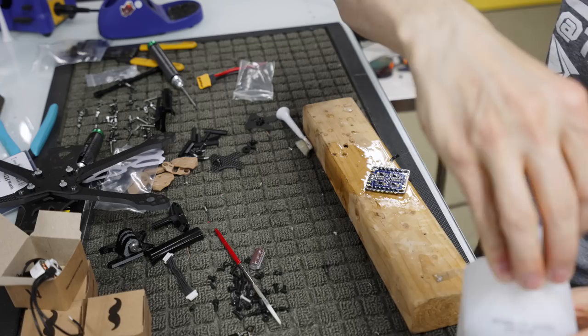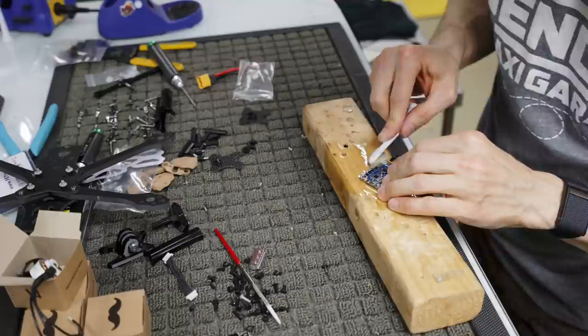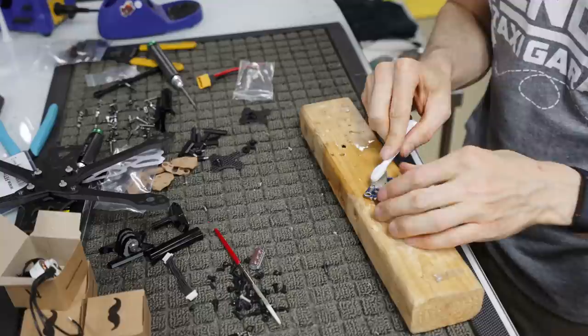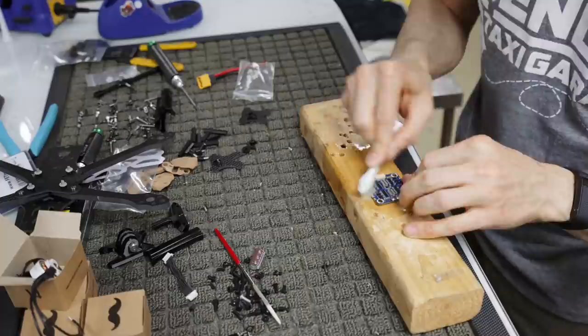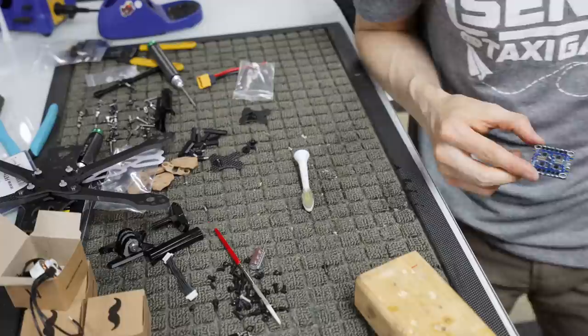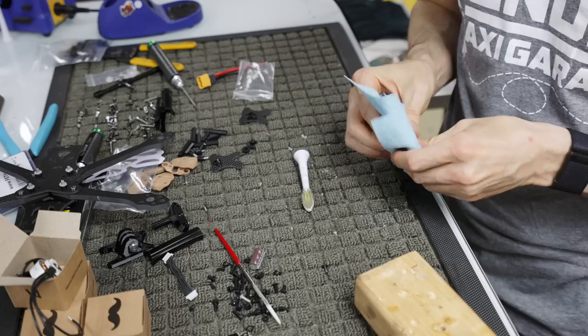I use 91% isopropyl, but you can use 80% or whatever you want to use. And all I'm doing is getting rid of all that excess rosin, or flux, depending on what you want to call it. And it's also getting all the little solder balls, if there were any, off the board itself. So again, isopropyl alcohol is going to evaporate very quickly, although I used quite a bit of it, so it might take more than a time, but I can just dab it off with a nice little shop towel. All right, so